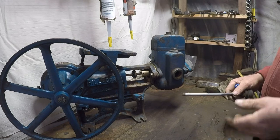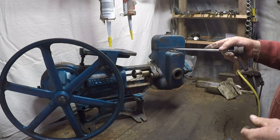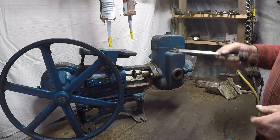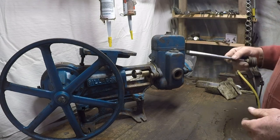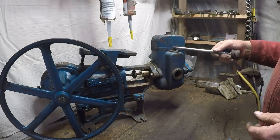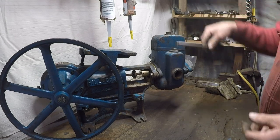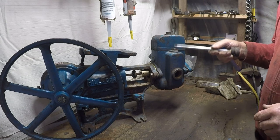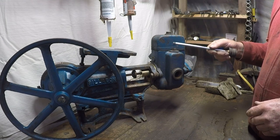Once you've addressed that and you're still getting air coming out, check a few other things. This priming plug — I always say don't ever use that. If you want to prime the pump, take the head off and prime it through there. Make sure you keep that bolt well greased inside that hole to stop it rusting out. If you prime often, you could add something here to pour water in, but having the head off just primes it so much quicker and easier. The tiniest leak there is going to cause issues with air getting in.